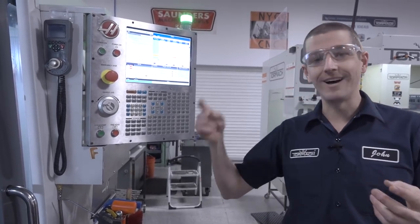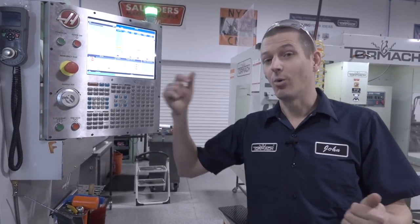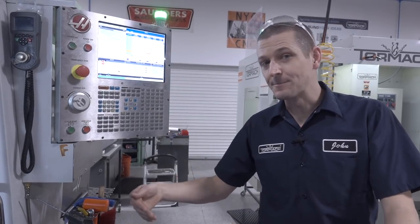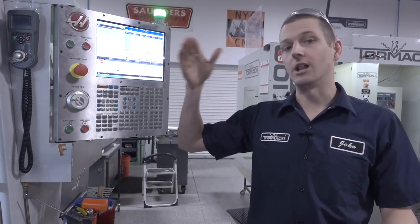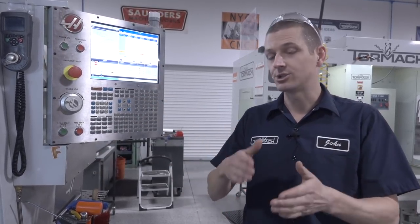Before we wrap up, two last things. One, I am so excited for IMTS this year because what I want to see is our people taking this to the next level. This is totally adequate for what we do, but I can't help but wonder: are we going to close the gap and have a tool that can actually automatically adjust and talk to the controller? So we can come in with our Renishaw, make a measurement, and then automatically adjust that diameter. Right now we break this boring down into chunks and we do QC to make sure we don't scrap a part. This material is really expensive, and if you blow a tolerance, it's scrap.